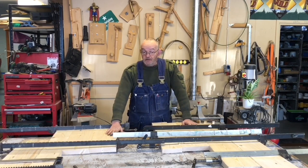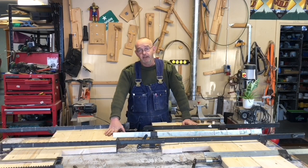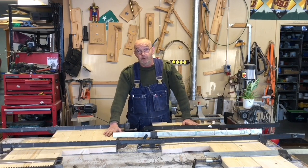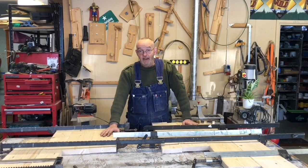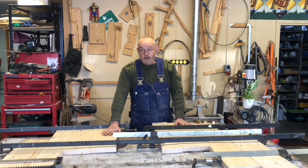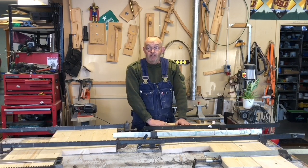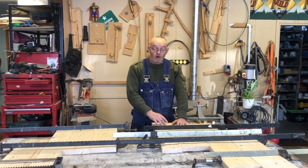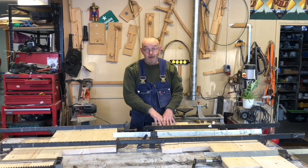In this particular instance, cost is relevant but irrelevant. It was relevant if I was going to trim out in hardwood, because I don't have hardwood here, but I do have lots of softwood. And since I machined it all myself and felled it, it's not so bad for me to do it this way. I don't have any suitable laminating glue, so I've laminated these together with polyurethane glue. I've also not put dowels or biscuits in there, so they are just laminated.